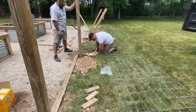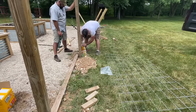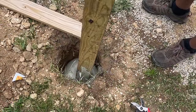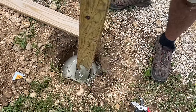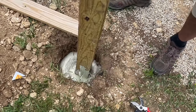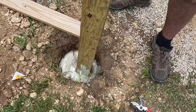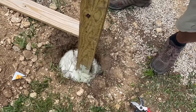Because of the speed of setting, it does make things a little easier but creates some other complications. Where you'd normally create a bracer to hold it up if you're using concrete, this sets so quickly you wouldn't even have time to set up bracers. And because you're holding it you're a little wobbly, which does create some small air pockets as it starts to expand.